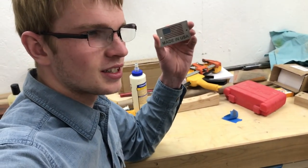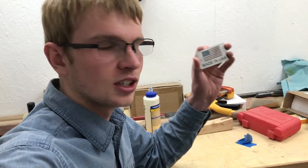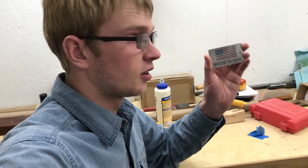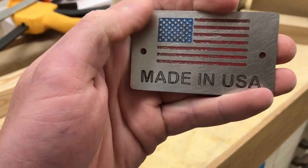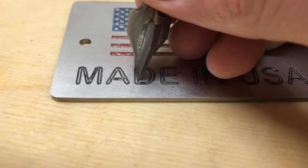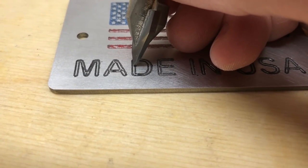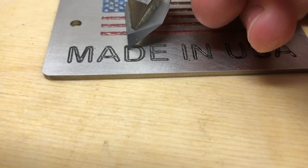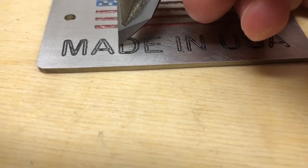I think that looks pretty cool — it's rustic. The problem is I wasn't going for rustic on this belt grinder; that's not the look I want. So I'm going to make another one for the belt grinder. I'm sure I'll make something else in the USA at some point and I can put this one on that. But for now I'm going to make another one with crisper lines, a higher polish on the finish, and without these little lines in the middle of the letters. On the original I only took two passes — one here and one here — and deflection caused there to be a little spot in between that didn't cut.